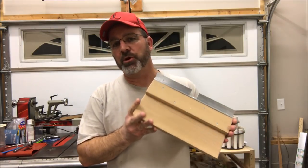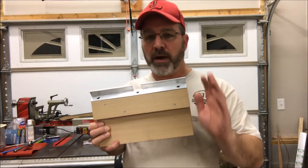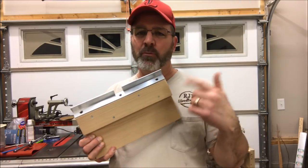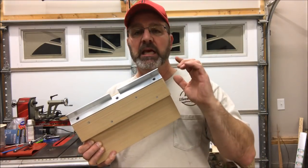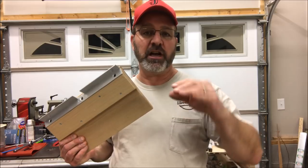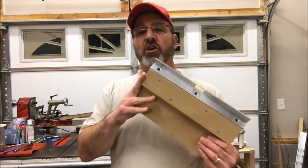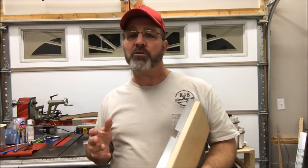I really hope you enjoyed the video on this jig and I hope I gave you enough information to where you're able to recreate the jig in your shop if you feel like it's something that will benefit you. I use this jig primarily on cross-cut or end-grain blanks. When turning a blank with the grain, I normally don't have a lot of trouble with chip-out, but if you're using a 45-degree cut or an end-grain blank, it can sometimes catch and basically rip large chunks off your blank — sometimes even completely off the tube. By taking the corners off, you reduce the surface area and the possibility of those catches, and it makes a huge difference. My success rate on end-grain blanks has gone up tremendously since starting to use this jig. If you have any questions please leave them in the comments below. I really appreciate you hanging out with me — you are always welcome in my shop. Come back and see me again real soon, and have a great evening everybody.